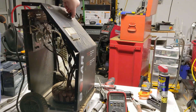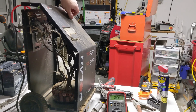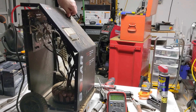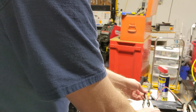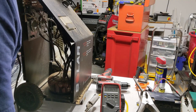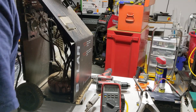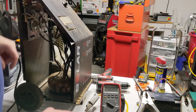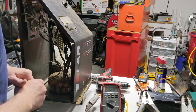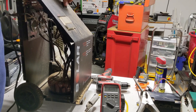After putting that wire back on, we go to the amp setting — yep, getting voltage output as we go across the selector switch. Hooking a battery up for an actual load: 13.6 volts at the 2 amp setting. About 15 volts on the 15 amp setting. About 16 volts on the 40 amp setting — quickly rising because that's a lot of current. Just a brief bump on the 200 amp just to show that it's working, and then back down.